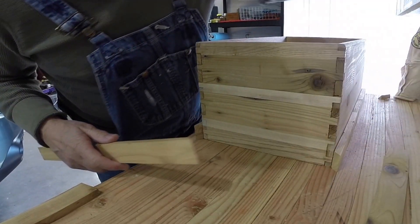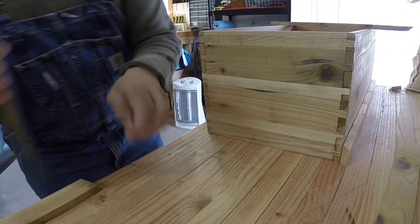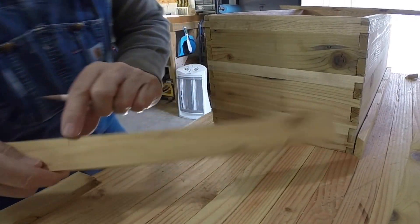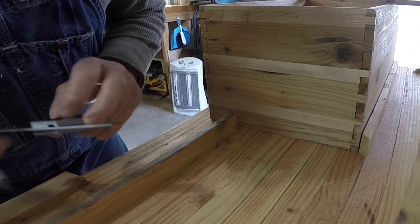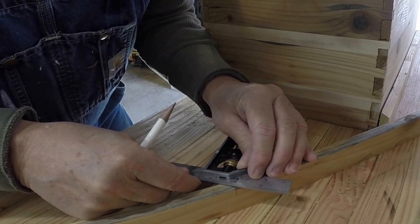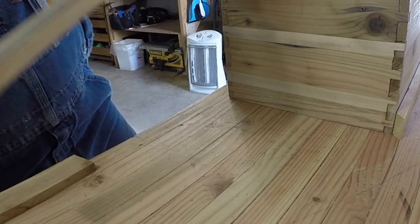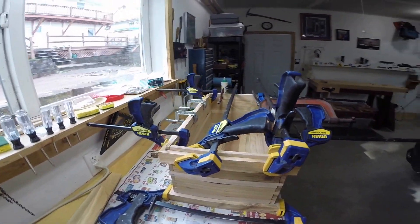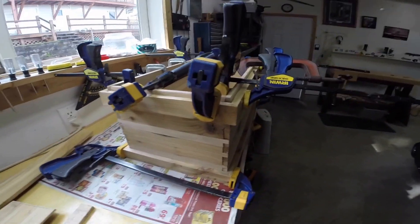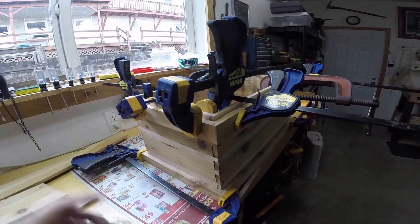Today I'm trying to cut this trim — I start here and make 45-degree cuts all the way around, ending up with a little piece on the back side. I lay my little 45 right up on the top of this guy — bam, that's the cut I'm looking for. Here's a look at our handiwork for the day. You can always use more clamps I suppose. That's the bottom trim and the upper trim all on — 45-degree glued and clamped.